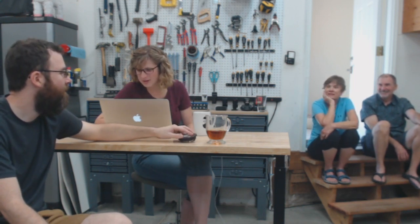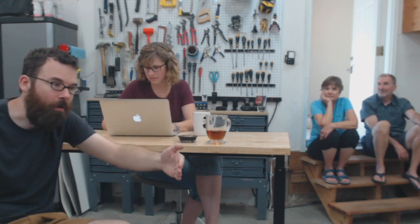Alex put in a last question. Is there a reason why you didn't use a timing belt on Crippling Depression? Ah, yes, that's a very good question. Let me talk about the drive, since I don't know if you're talking about the drive or the weapon. I didn't use a timing belt for the drive on Crippling Depression because of width. In those drive pods, I have a bearing, the hub for the actual wheel, then the sprockets, some spacers and other things, and then the motor. The shafts are not that long, so if I went with a timing pulley, I would actually double the width. Chains are a lot thinner, so I can do a chain in less width than a timing pulley, so that's why I went with that.